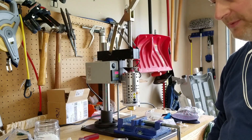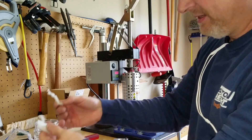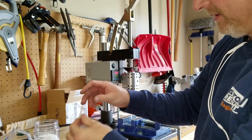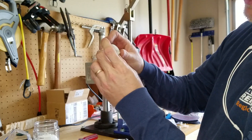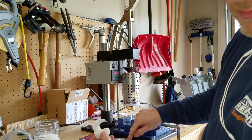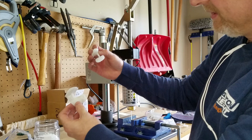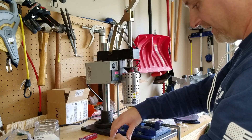I will try different types of materials to see what works. As you can see, I had some parts that didn't actually go all the way through, and that's the mold that came with it. You can end up with some of this stuff if you don't get the nozzle lined up with the sprue, and you get that kind of result. So you have to experiment just a little bit until you get exactly what you're looking for.